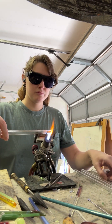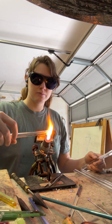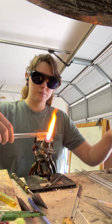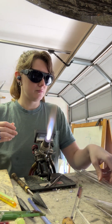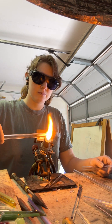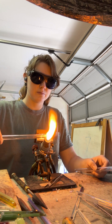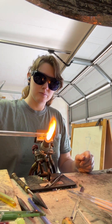After I make the amount of tubing that I desire, I'm going to go in and flame polish both sides of the tubing so that when I put the end of the tube into my blow hose, no matter which end it is, it won't tear up the rubber end of my blow hose. After years of accidentally cutting the rubber and needing to replace it, I now just flame polish both sides out of habit so they're ready to go as soon as I need them.